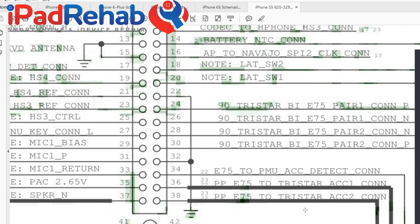But conversely, the thing that you've plugged up the ass of the phone could be, for example, your computer, in which case, oh, you want to do data transfer, okay. Or it could be some piece of shit Chinese fan. Oh, you want me to actually send you power. All right, well, we can do that. So TriStar is just the restaurant host that's going to have this little chat and figure out who's knocking at the door.